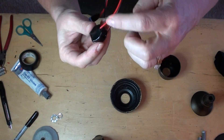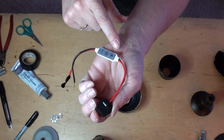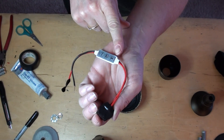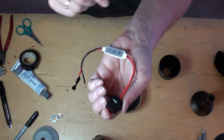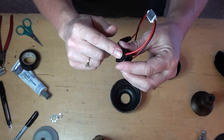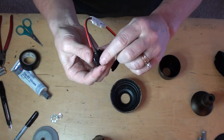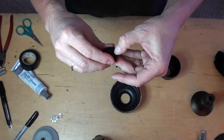That will run in series. Wrap electrical tape around and make sure they're real tight. They're marked positive and negative, so that's easy. On the dimmer, it tells you which wire goes to the battery side and which goes to the LED side — red and black — so the red goes to positive, black goes to ground.